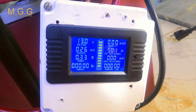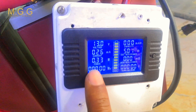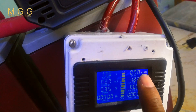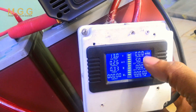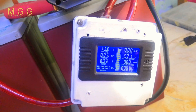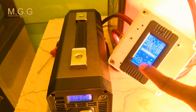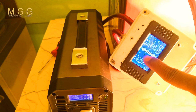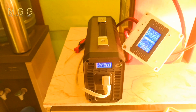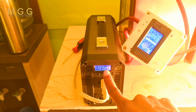Right away you can see the meter is on. These readings are the most important part of what we need to track — how much the battery runs down to and how much time it gives us. The battery is still at 13 volts. Right now we are pulling 20 amps and 261 watts. According to the battery's ratings, we need to get five hours and approximately 180 amp hours of usage.